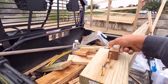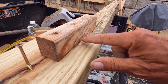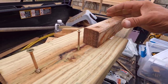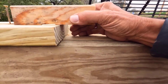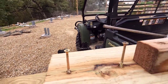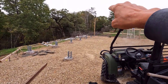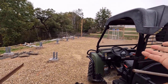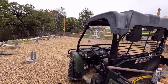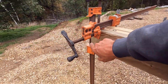Next thing I do, these cleats are made. This screw is put in first, and then this screw has a shim at the top so that this is kind of splayed out. The girt fits right in here. These go right on the line — these lines are the ones I created with my story pole in an earlier video. So you get it right on the line, screw it in place. Then once this is tipped up into place, you just put the girts right into it, and if the girt is crooked, you can straighten it out.